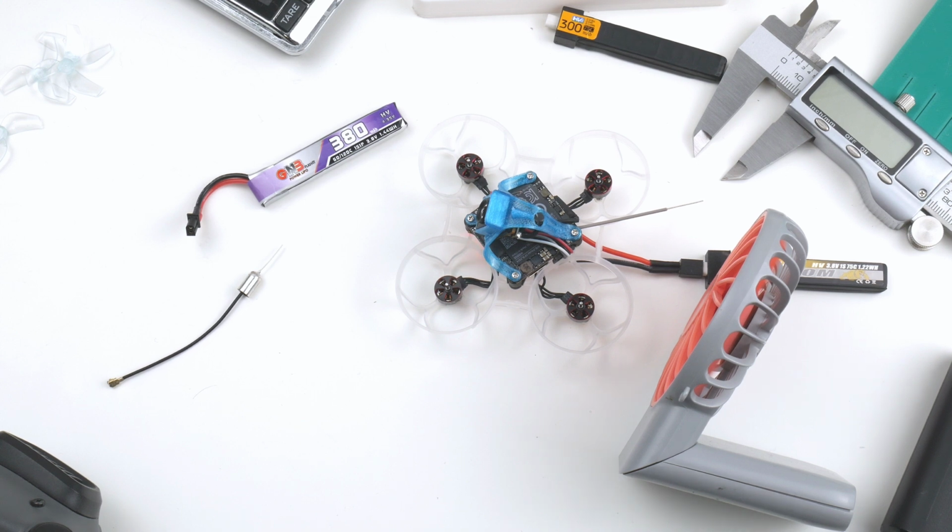So I'm going to set that all up, I'll configure Betaflight and also the OSD and everything and bind it to my controller, and we'll go for a test flight. Okay, so here's my first flight. I'm just about to take off, and I've set the video recording and also the stream as 1080p at 100 frames per second because Madstech had said that that was what drew the lowest current. So here we go, I'm about to take off and you'll see what happens.